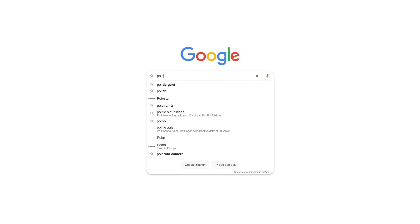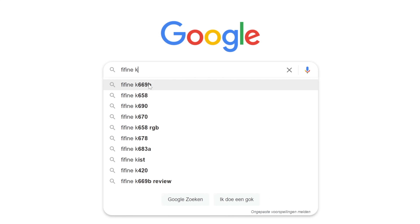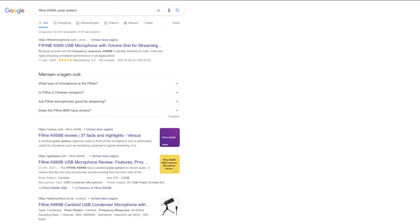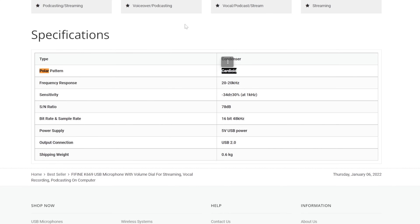There's something else also really important in terms of how you speak into your mic. Make sure you position it the right way, but it's also important to know the polar pattern. You can just go to Google and search for 'polar pattern.' What it means is where your mic is recording sound from. Most USB microphones are cardioid, which means they mainly record from the front, a bit to the side, and as little as possible from the back. I'll look up the Fifine K669B polar pattern — and as you can see: polar pattern cardioid.